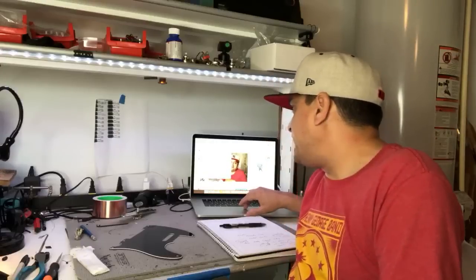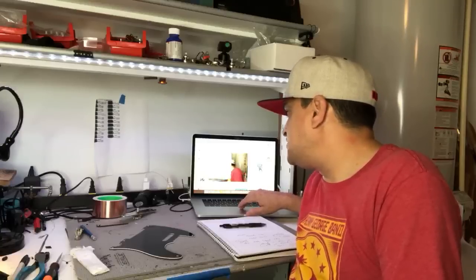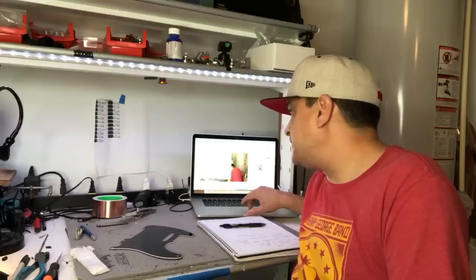For guitars without large pickguards, are we counting on the shielded braided wire to do the job of the copper tape? No, because there's not enough square inches there. Number one. Number two, if you have humbuckers, none of this matters. Everybody wants to shield humbucker guitars to make them quieter. It doesn't matter. I mean, you could get a marginal amount of benefit from it.